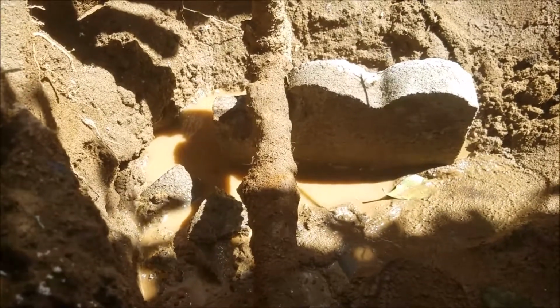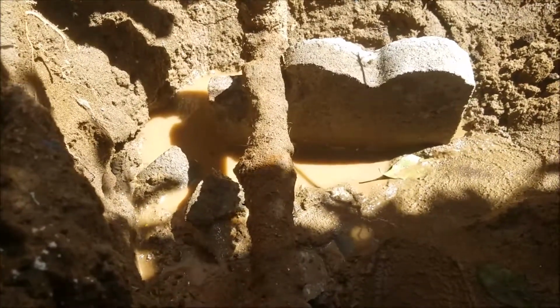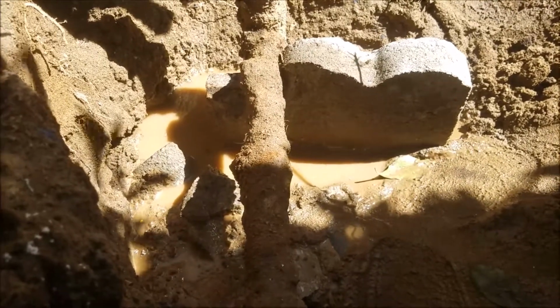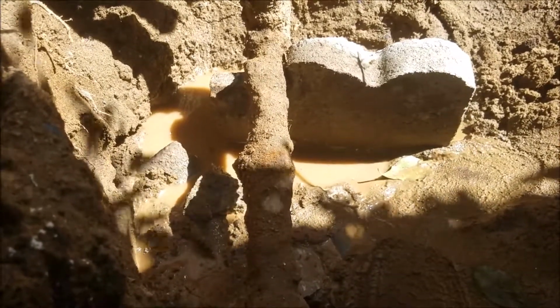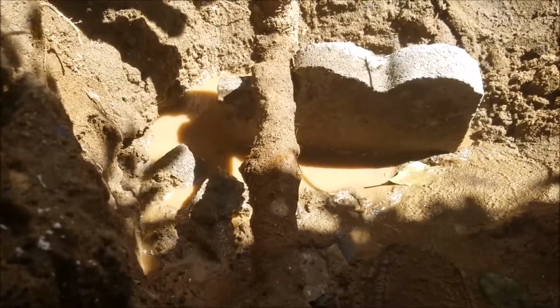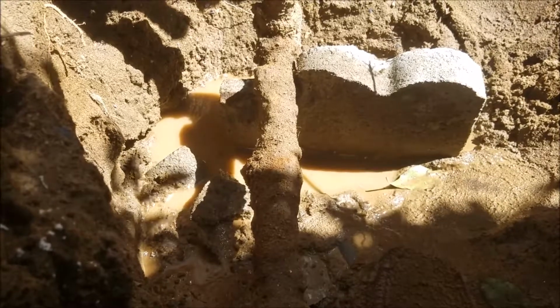So the dirt and the rust and the water form a nice little cocoon. Every time you touch the pipe, you create a leak further down the line. So this, we dug back pretty far. We couldn't find any PVC in the yard piping, so I'm guessing that it goes iron pipe all the way to the curb. They're out in the yard somewhere.